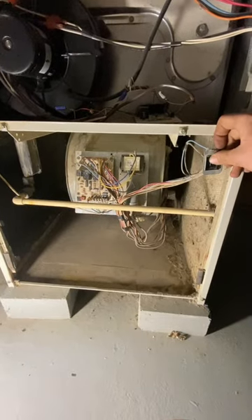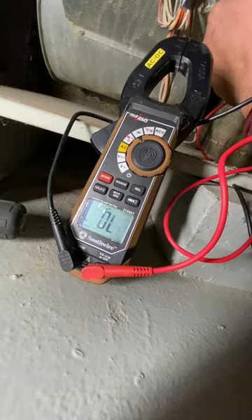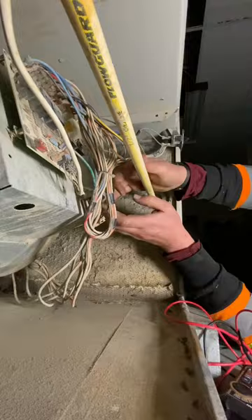This is the fourth work day in a row where I've put in over 12 hours. We got another no heat call and the fan motor's a little grumpy. Head out to the truck, grab the Amrad Turbo 200 to see if it's the capacitor, give it a test, and no dice. So we're gonna have to pull this thing and take it back to the shop.